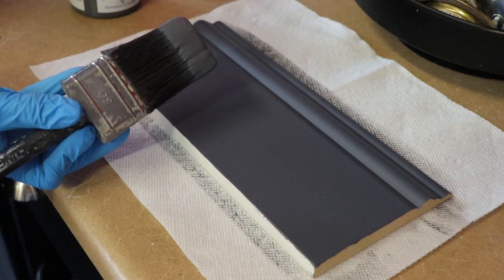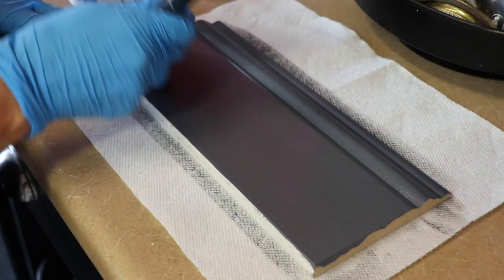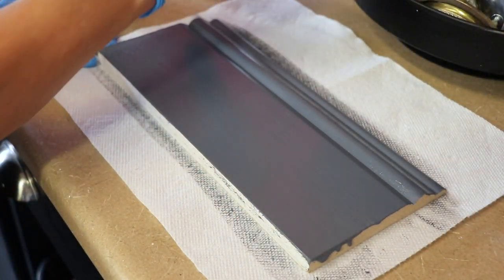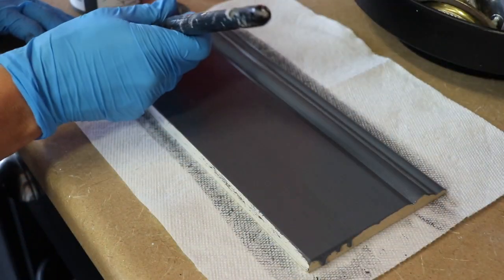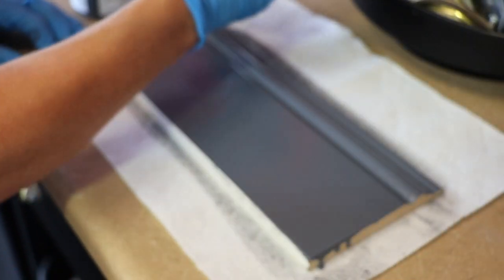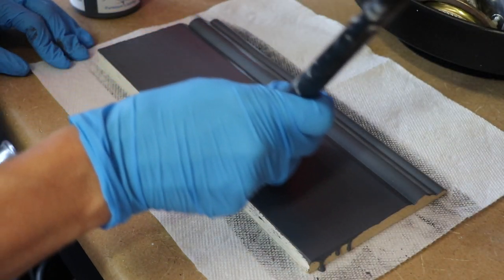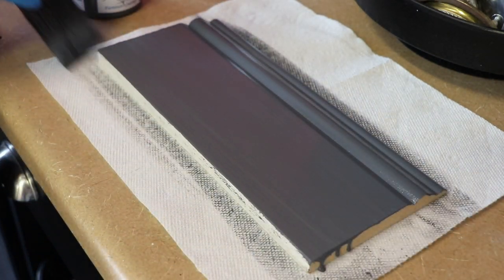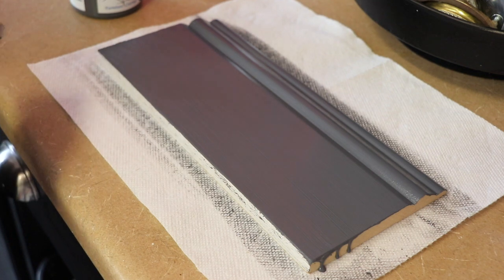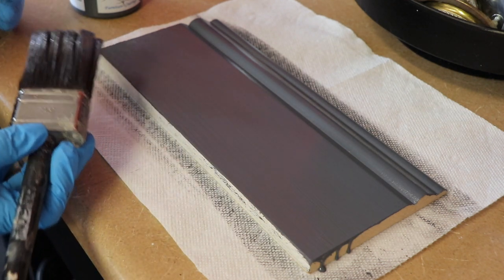I'm really not going to load up too heavy — for coverage purposes it doesn't need a whole lot. The second coat is going on really nicely. No grab. It feels really smooth and easy to apply. I've had certain paints — whether chalk paint or milk paint — where the second coat doesn't go on as smoothly, but this one is particularly easy. I'm going over it several times to see how many passes I can make before it gives me that 'okay, stop now' feeling. About three passes over the same area is the max before you start to alter the finish.